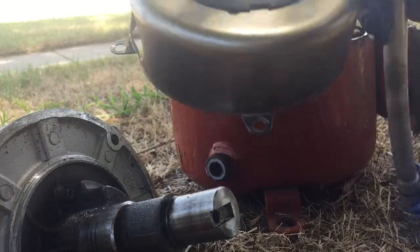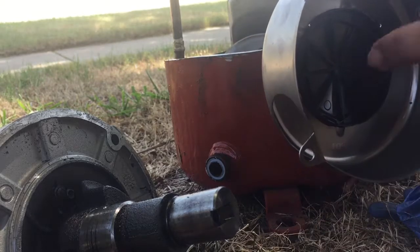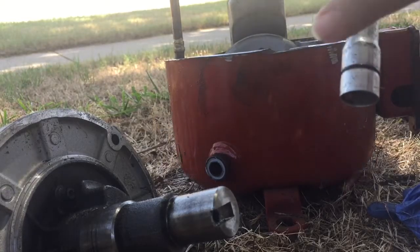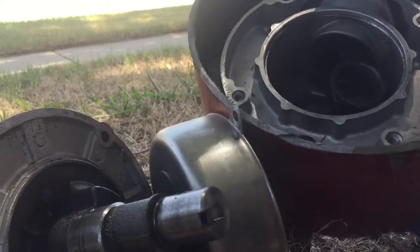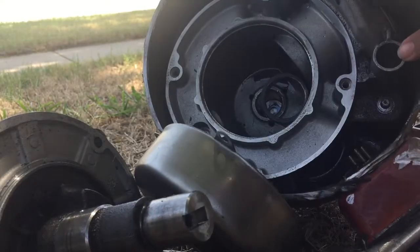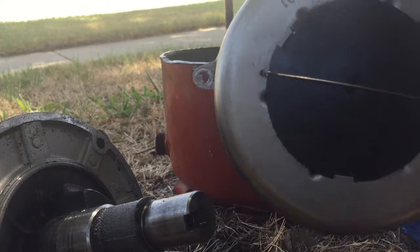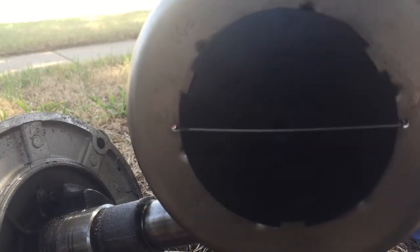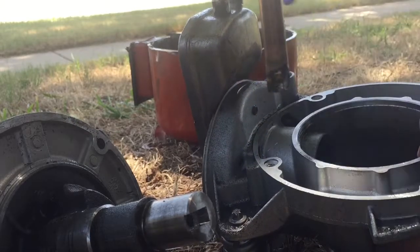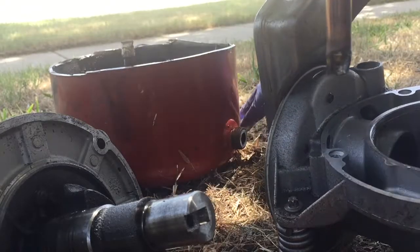This is pretty cool. This goes on top of the motor windings, and the suction gas comes through here, around the top of the motor windings, and down this tube into the head assembly — right there for this compressor. It says Trane on it. Here's the discharge line — it goes into the crankcase and comes out the bottom on this compressor right there.